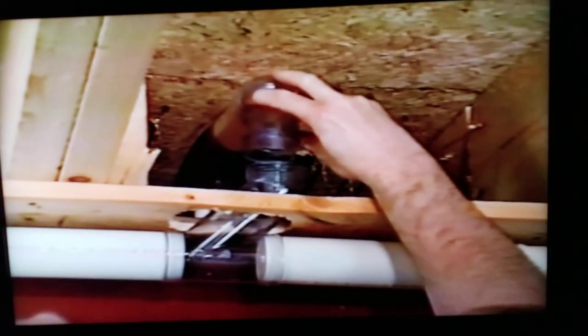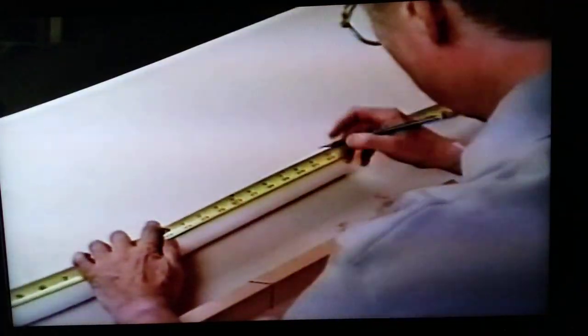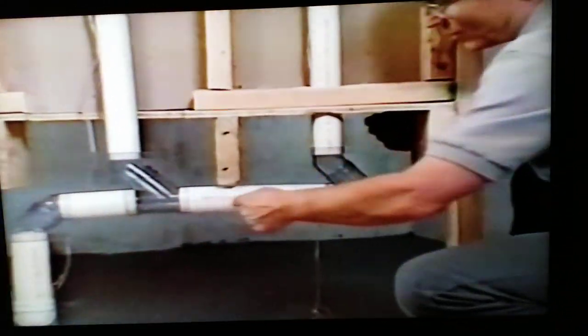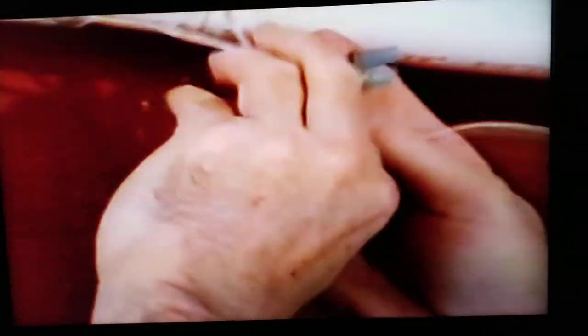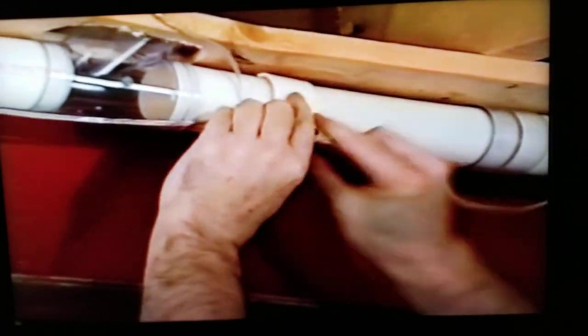If there are inlets in the basement, connect them to the main trunk line as well. Nail a mounting bracket to a stud, glue with white 90-degree elbow to the ring on the back, then measure, cut, deburr, and trial fit — then glue in place. In a similar manner, glue and connect all of the inlet valves to the main trunk line. But, and this is important, always make sure the sweep of your Y fitting is towards the power unit. Bring the low voltage wire along and splice them together at each Y junction. As you go along, you can either tape wire to the pipe or cut pieces of pipe into one and a half inch lengths to make neat little clips for the wire instead.